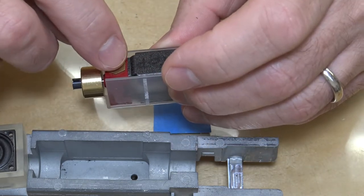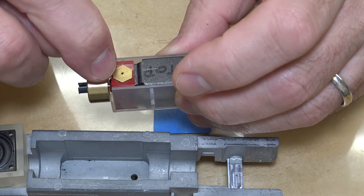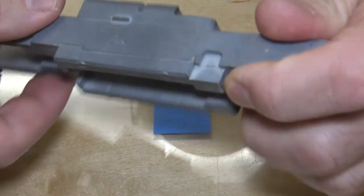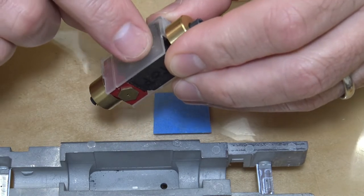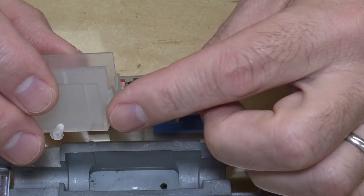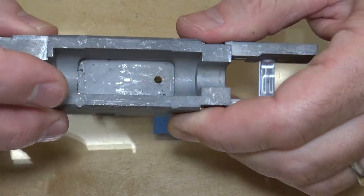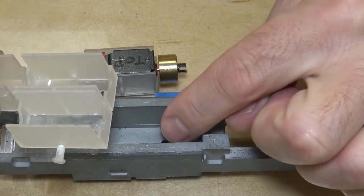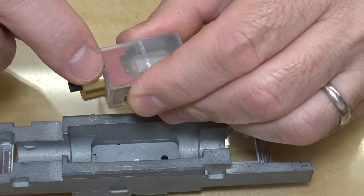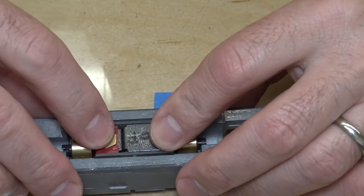And then I have a cutout that you've seen in the DCC board mount for the middle, because I'm going to solder a wire up to here too. So now this fits right down in there. Now, these enclosures, or the motor cradle, they come with sharp corners here, and they did that for strength when they're building the part. Because of these radiuses inside, I can't fit the sharp corner down in there. But it's a very, very small amount that needs to be removed. So I have a corner rounding milling bit that I used to corner round these, basically routed these round. So now that just drops down like that.